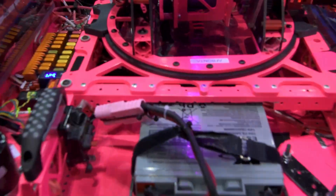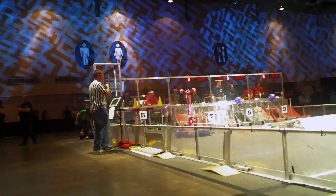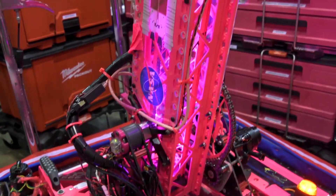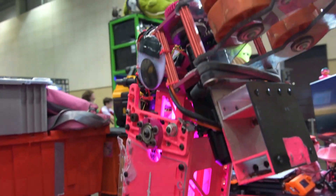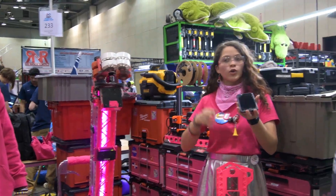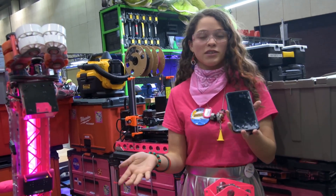It's a telescoping arm — the definition of a pink arm is a telescoping arm on a pivot — but this one we actually decided to put on a full 360 turret. So when it matches, since our gripper doesn't go backwards and forwards, our turret is able to spin fully for us. When we're coming back, the drivers are able to focus on driving the robot, and the tower operator is able to focus on spinning the turret and scoring. We like to smash up against one of the two sidewalls so we're in the same position every single time. When we're picking up, the human player angles it for us, and when we're scoring, we move the turret for a few minuscule adjustments to make sure we're right on that pole — we almost never miss because of that now.